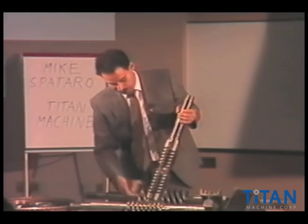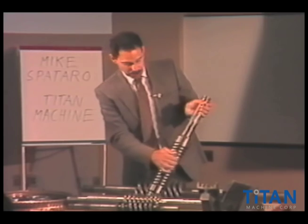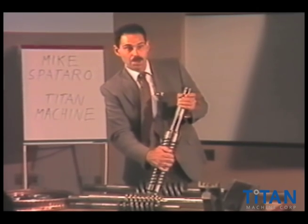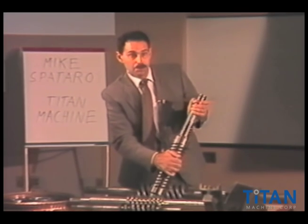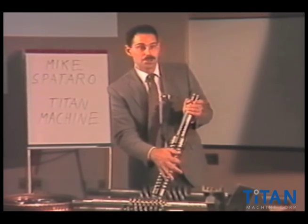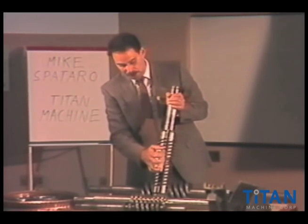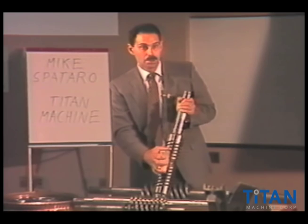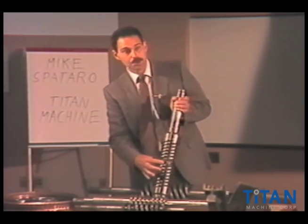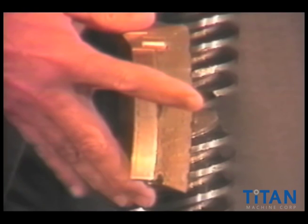When I put this in, it's actually meshing with some of the gear teeth that are not doing the work, and it's preventing it from actually moving. So there's no indication that you have any backlash in the machine, because no matter where you put it, that gear tooth is meshing. But where all the pressure is is usually down below — what's carrying this whole thing are the teeth in a different area.